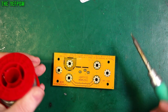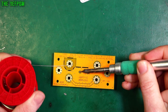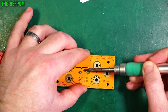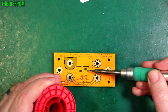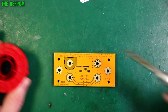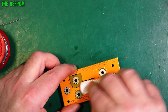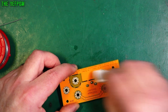Let's solder this up. I'm using silver solder for this — haven't added any extra flux. Silver solder works quite well anyway. Put some on there, make sure it's flat. This trimmer naturally sits slightly crooked, which I discovered yesterday doing the other one — but it's actually beneficial because it helps it to miss the guard terminal when there's a plug in there. I'll just leave it as it is. Happy with that. Let me clean up and get the flux off, because flux will affect the readings depending on humidity or dust.